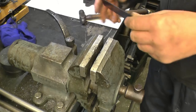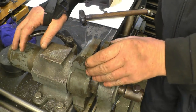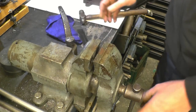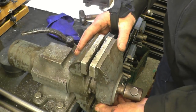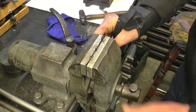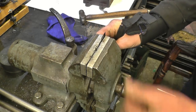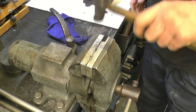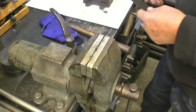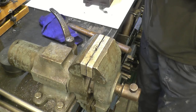I've got some spring steel in here that'll be ideal to make the ring clamp out of. You can use anything really — aluminium works. It doesn't have to be anything fantastic. First thing I'll do is bend the end at 90 degrees. I'll use that side of the vice. These aluminium soft jaws have been abused — I've only got myself to blame because that's only me uses it. Right, so we need to bend that across to 90 degrees and wrap this around the piston, or around something the same size as the piston. It's actually a little bit springy but I think it'll do the job.